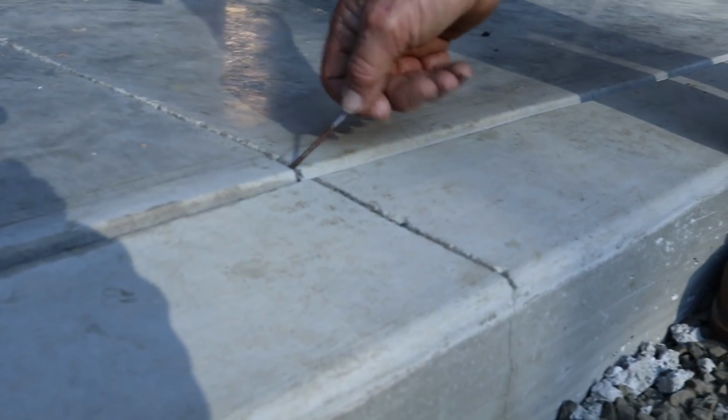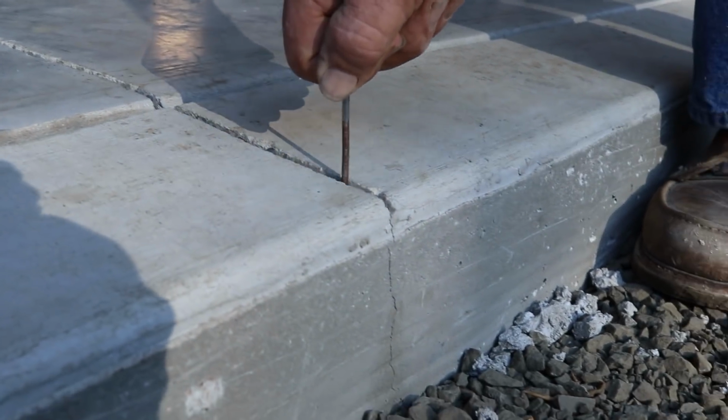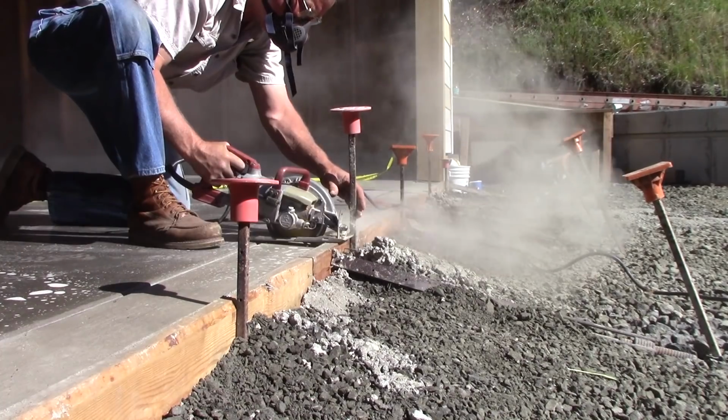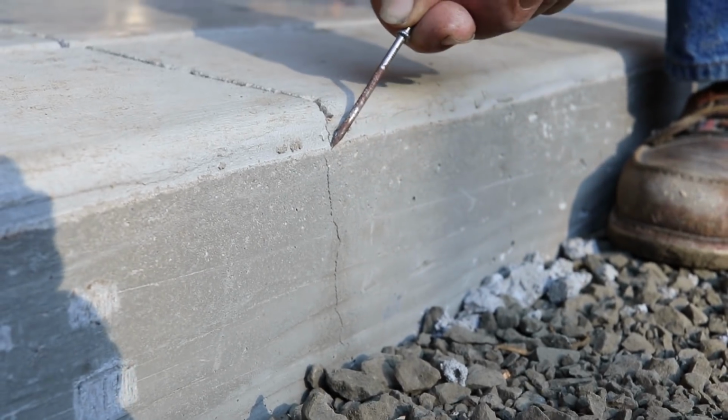And what I mean by that is, yep, this floor is cracked, and all the cracks except one so far are in the bottom of the saw cuts. Let me show you. This saw cut stopped right here with a soft cut, and I finished it the next day with a skill saw. And look at that. Beautifully cracked, exactly where we want it to.